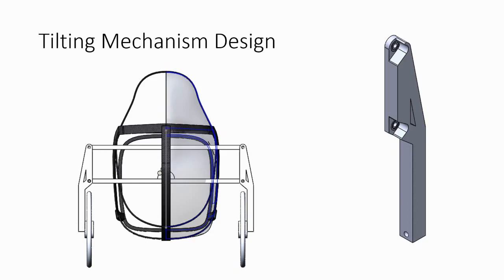Without this geometry, the contact point between the wheels and the ground will shift side to side as the bike tilts. This is desirable to avoid, as it will make the wheels skid, causing increased wear on the tires and stressing the entire tilting system. Additionally, the vertical bars were designed with cutouts to fit neatly together. They also leave a space for ball bearings to be inserted in order to make the tilt as smooth as possible.